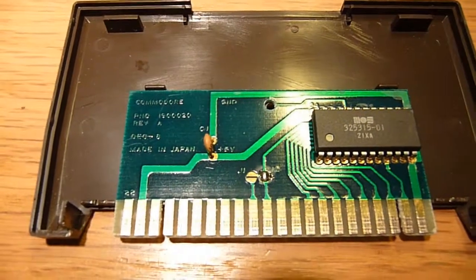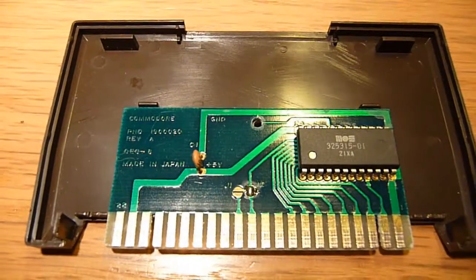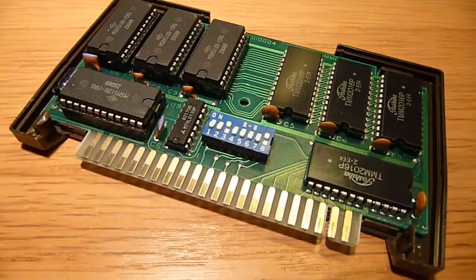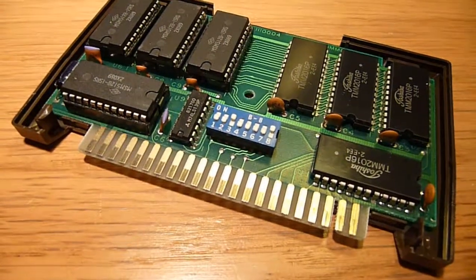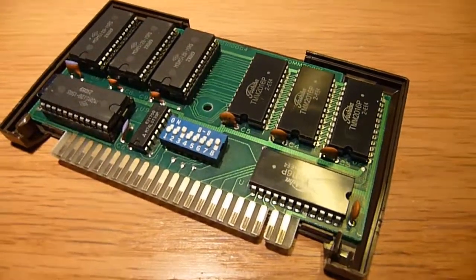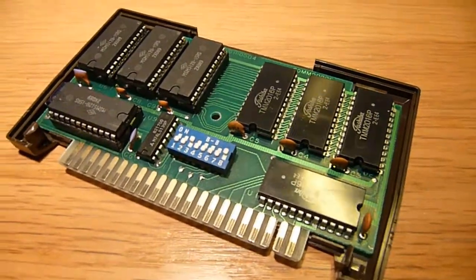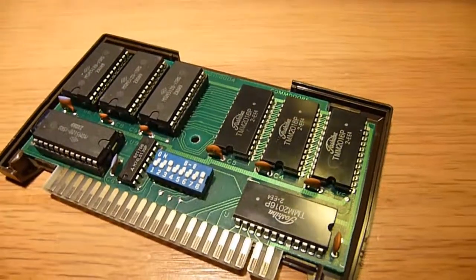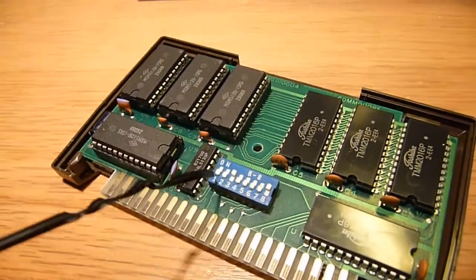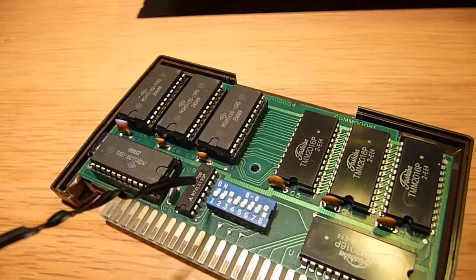I hope this has been cool — this little bonus for you guys. I'll just shut these cartridges back together and I'll see you in another one. But wait — you think we were done? No, we were not. I just made some last-minute updates on what the switches are all about, because I couldn't really dig that when we weren't done. With those switches, you can kind of change the block where the 16K of RAM will mount in the VIC-20's memory map.